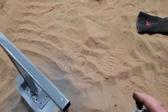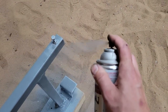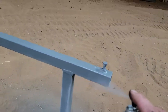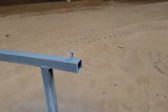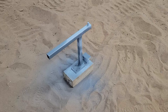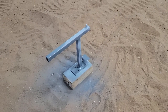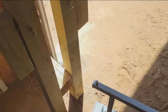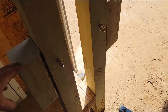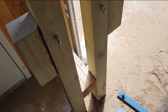The plate at the bottom I looked up on the Menards website — it's about six bucks. One five-foot piece of one and a quarter inch tubing is about ten dollars. If you had to make the headpiece, you'd need a one-inch piece of square tubing three feet long and a flat eighth-inch piece of steel six by eight inches to bend into the headpiece. All said and done, you could build this whole project for under 60 bucks if you've got a welder.